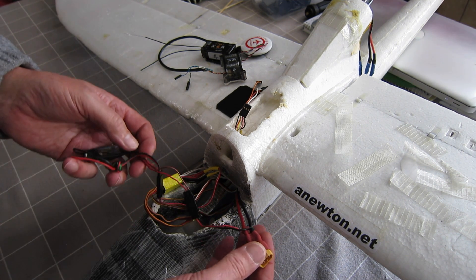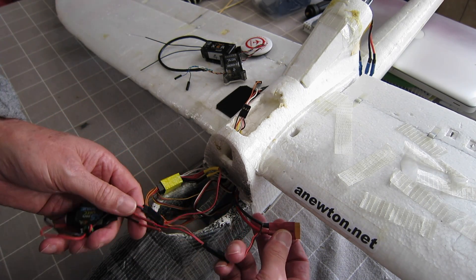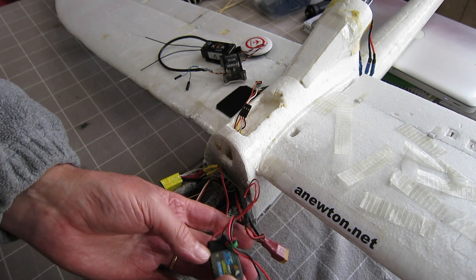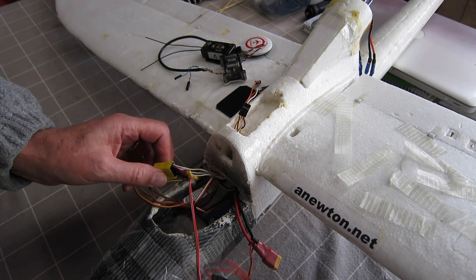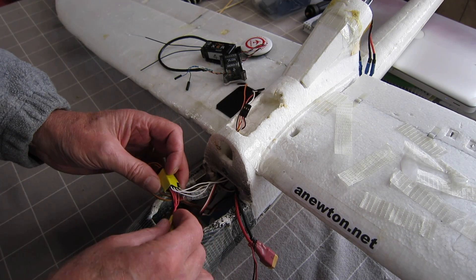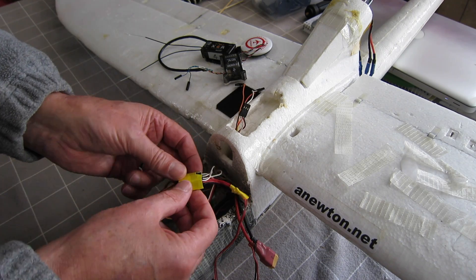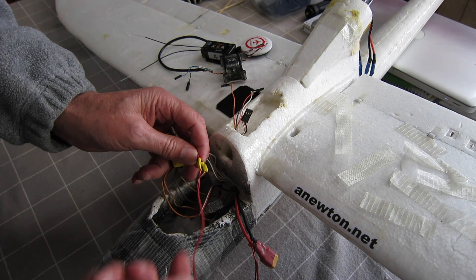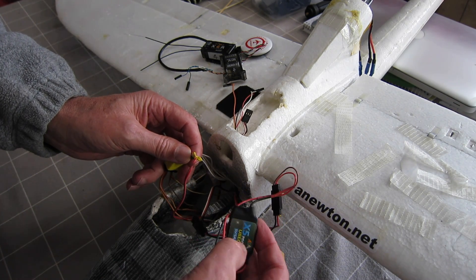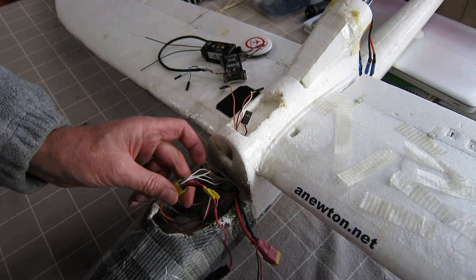This complicated mess of connections is basically just your XD60. I've just got a power tapping off here, a 5 amp BEC to power all the servos. I've got all my servo wires coming in here, plugging into this little box. All the power and grounds connected, coming out there via the BEC, so all the servos are powered from this BEC.